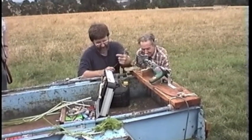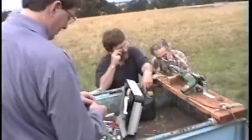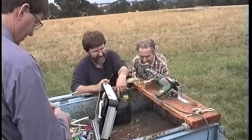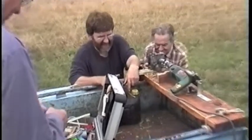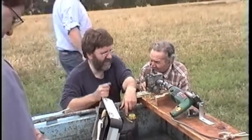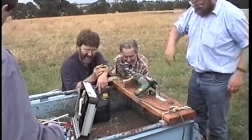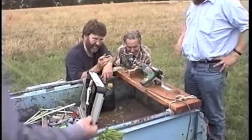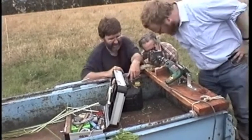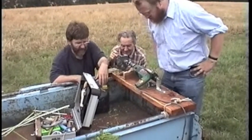No. Other end of the scale. Yeah. But then your mechanical drive operating 10 of those machines is a lot of moving parts. Yep, it is. However, if they are suitably reliable and robust and prove to be so, and they've got a service life of 10,000 hours, and they're cheap to replace if you drop a brick in it. Yeah. And if we demonstrate the robustness of this by putting a piece of fence wire through it and then a hemp stalk and it decorticates after we put the fence wire through it, then we'll have been very clever. But that's one of the things we're going to try to do. So that's why you've got the spring-loaded top piece on there. Yeah, although that's not the way we're intending to go in the future, but it's that sort of coping strategy.